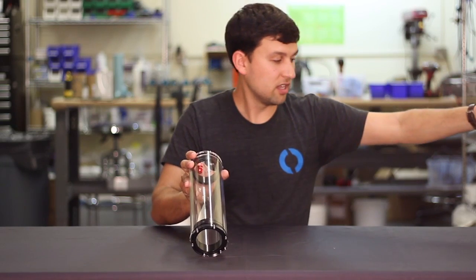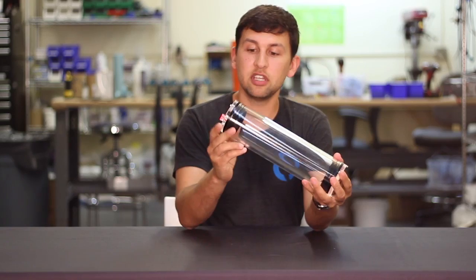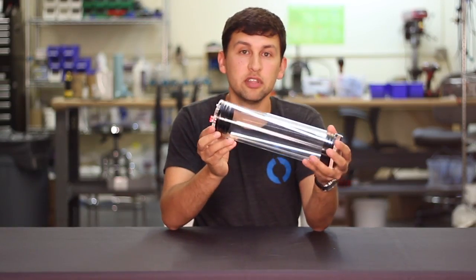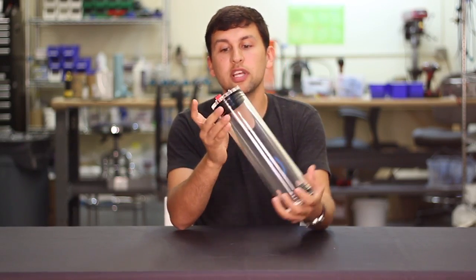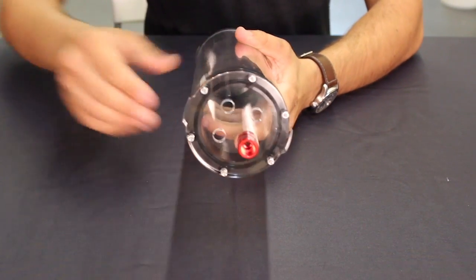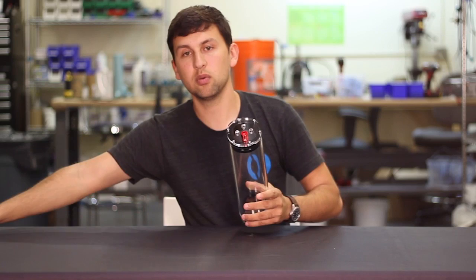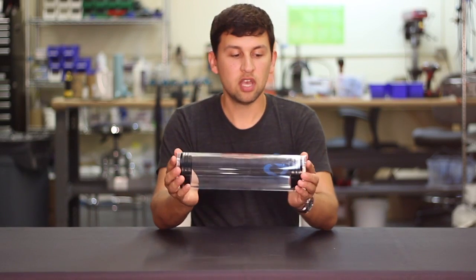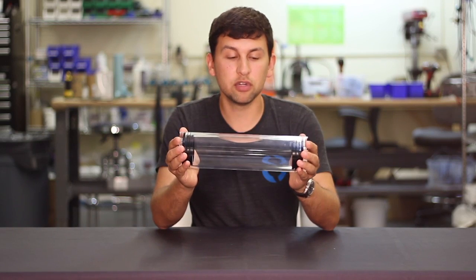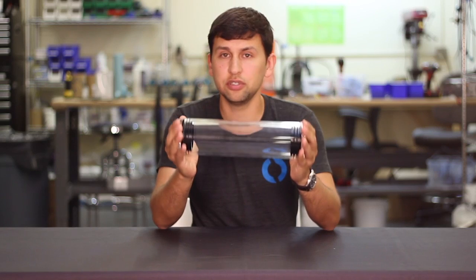It's actually the right size — you can make an entire ROV with just this enclosure. It comes standard with the same double o-ring flanges and face seals for the end caps that are on the 4-inch enclosure, as well as a solid clear end cap, an end cap with four holes, and you can also choose an end cap with seven holes for applications with more wires coming from the enclosure. The 3-inch enclosure also comes in customizable lengths just like the 2-inch and 4-inch series, so that you can build an enclosure anywhere from a few inches long to up to six feet long.